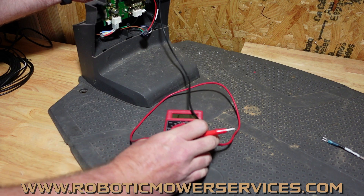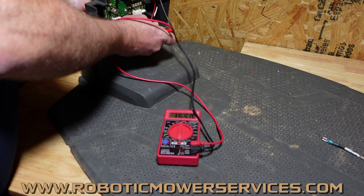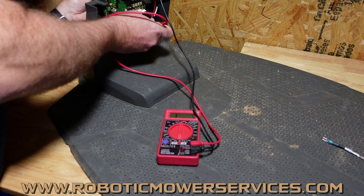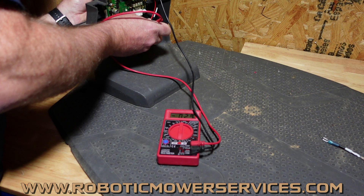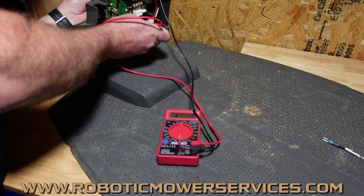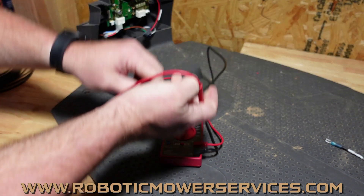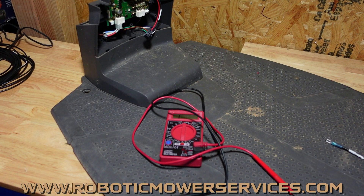What I'd recommend to make it even easier: unplug the low voltage cable and then just test from here to the back side where your low voltage cable plugs in. You should have one ohm or less on each of these. There we go — one ohm on the first one, and moving over to the other one, again we're at one ohm. So by process of elimination, we know that our charging station harness is good, which means the low voltage cable was the problem.